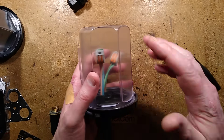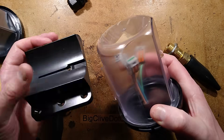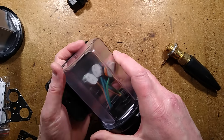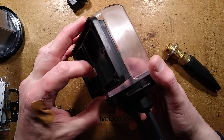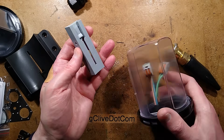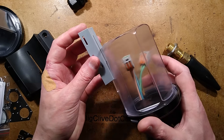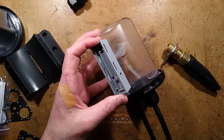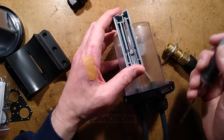The capsule comes in black or clear and once you've terminated it, it can either be buried or clipped into a bracket that mounts on a post or wall — when it clips in it makes a solid click. You also get a bracket designed to be banded onto a pole, useful for street lighting poles. A more recent version actually has a hole that allows you to put a screwdriver in to prise the little clip back and release it.